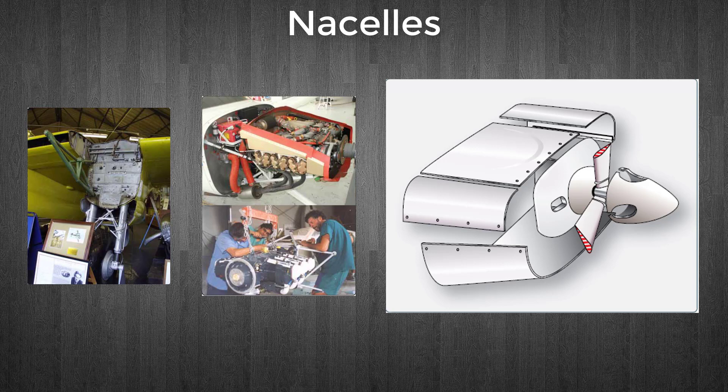The exterior of a nacelle is covered with a skin or fitted with a cowling which can be opened to access the engine and components inside. Both are usually made of sheet aluminium or magnesium alloy, with stainless steel or titanium alloys being used in high temperature areas such as around the exhaust exit. The skin is typically attached to the framework with rivets. Cowling refers to the detachable panels covering areas into which access must be gained regularly, such as the engine and its accessories. It is designed to provide a smooth airflow over the nacelle and to protect the engine from damage.